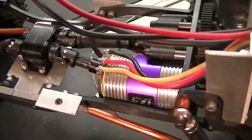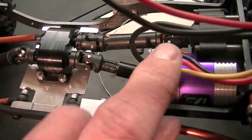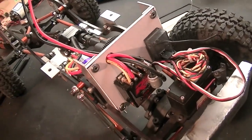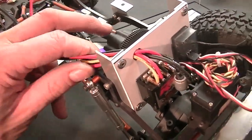You also want to make sure that the joint looks quite shiny, because if it looks dull, that means you've got a cold solder joint, which means it's a bad connection. It was probably the wire moving while the solder was hardening. But yeah, this is working out good.